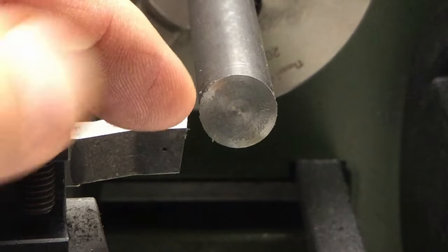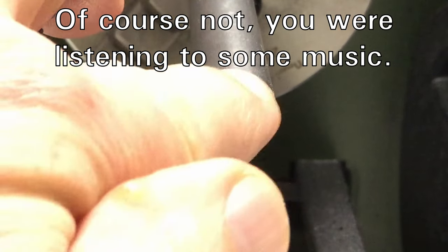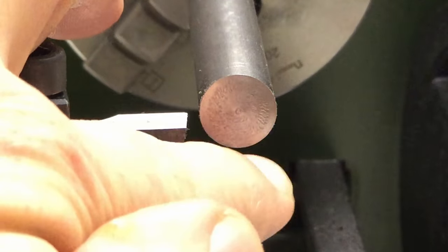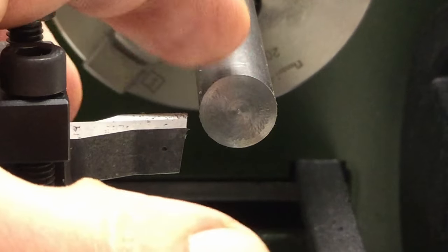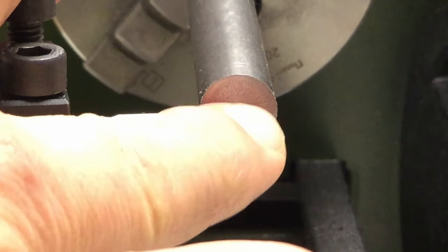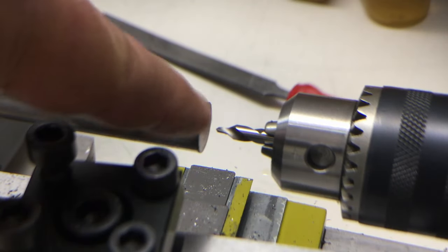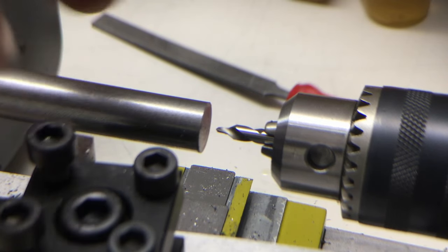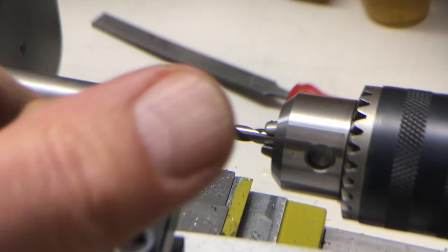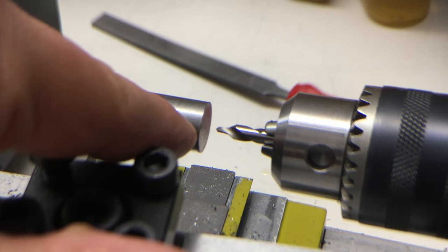There was quite some chatter when I did that face — you can actually see it. So yeah, that's the first time I'm doing steel on that little lathe and we're getting to its limitations. Next, I'll drill a tiny center hole because with that much chatter I don't really trust turning down the whole length without any support at the other end.